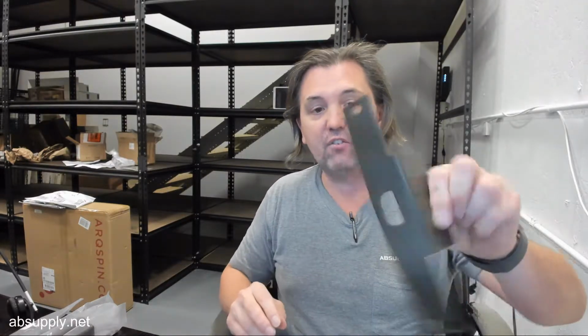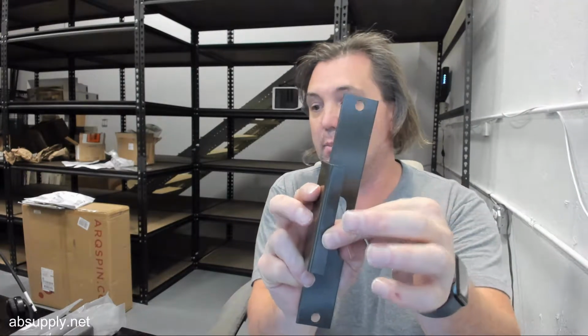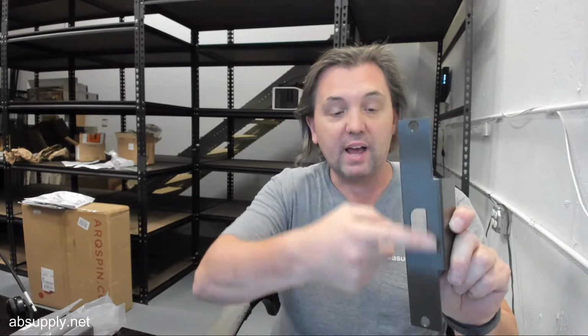Okay, weigh about 0.55 pound, so over 1/2 pound each, that's for sure, at least with its screw package. Now that link to the product catalog will allow you to review the other fillers that are available. You'll take note that the AF291 is the same height and width, but does not feature the return that's back here. And you'll see the other conversion plates that are there, in addition to the AF29L, which is the blank version where you're going to simply close off that electric strike completely. Maybe you were upgrading or changing to an electrified exit device or lock set, more likely, and moving the electrified portion off the frame, I suppose.